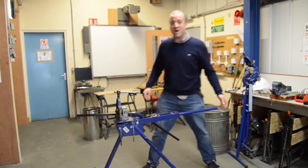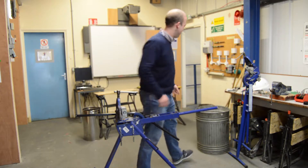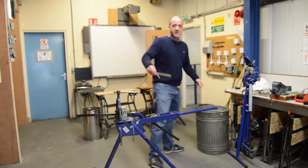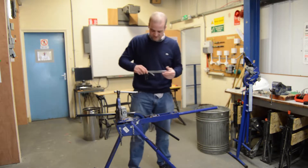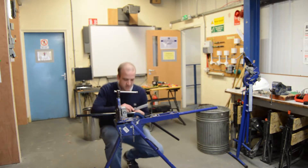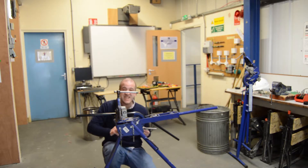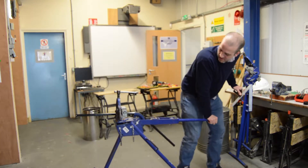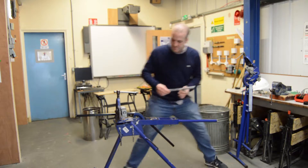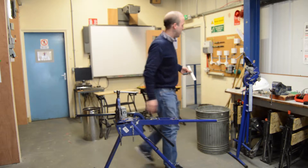Some of you might be thinking you don't know what 45 degrees is — well let me show you. Using our engineer square, that angle there is 45 degrees. So it's only roughly — we put it up to there, and I think by my eye I need to give that a tad more. So that's what I'm going to do. And once again we check it, and I'm pretty happy that that's 45 degrees.